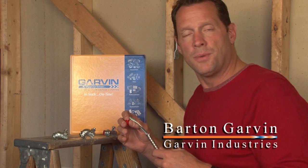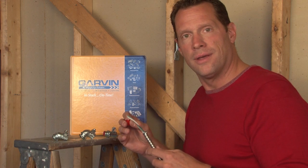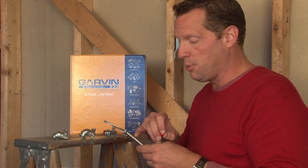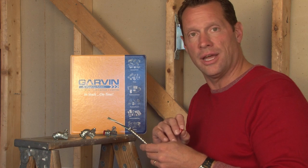When using flexible metal conduit to run your branch circuit wiring, it's very important that you insulate the conductors from the sharp portion of the flexible metal conduit that you have cut to your desired length.